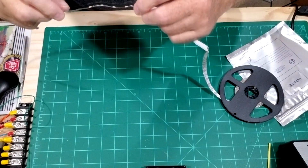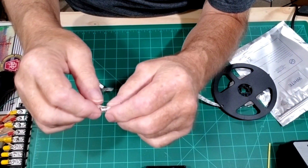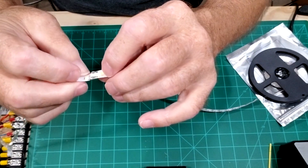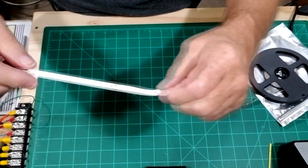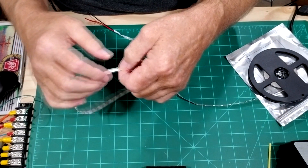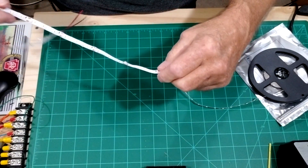Let's get started. I was going to cut off 10 sets — that would be 30 LEDs — but I noticed they've already done the work for me: every 10 sets they have these things spliced in. So I'm just going to break this off right here and work with the first 10. I might come up to the 11th one so I have a good clean soldering pad to demonstrate on. We should put a new blade on our exacto tool so we get a good cut on the tape.